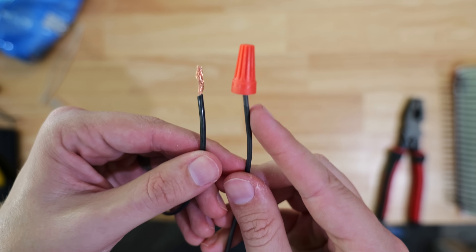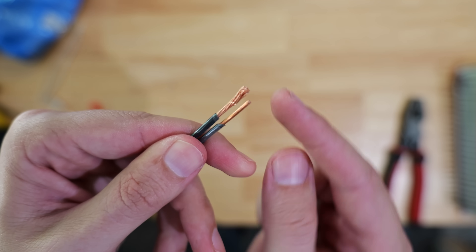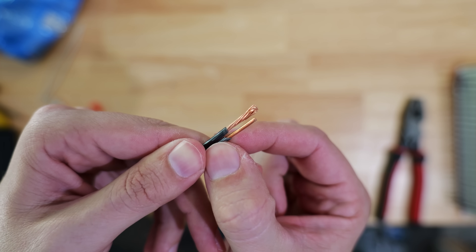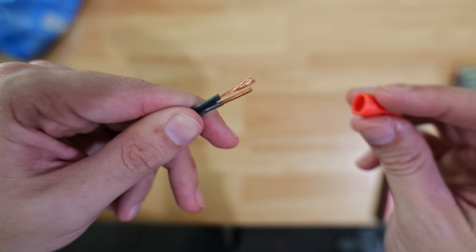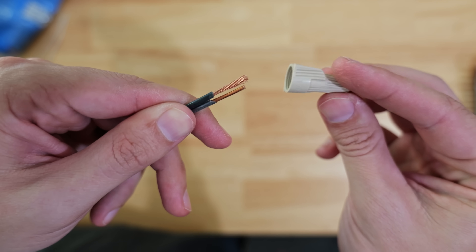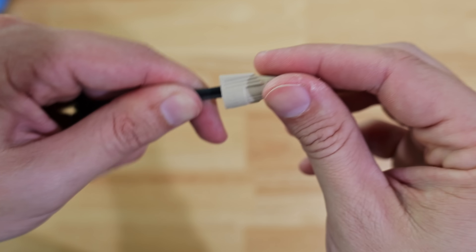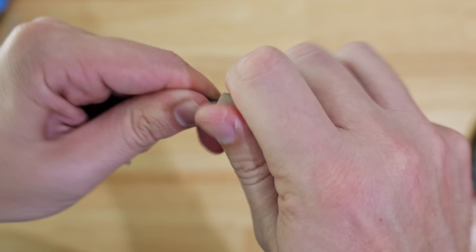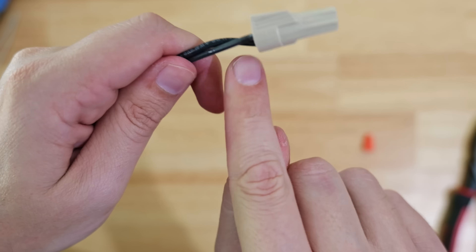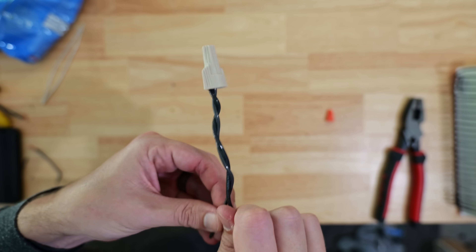The easiest way this should be done is to take your two conductors and make the stranded wire a little bit longer than the solid core wire at the starting point before putting the wire nut on. Instead of using a cheap wire nut, it's always better to use a name brand wire nut like the one made by Ideal, because they do a better job of wrapping the wires. Put those in and tighten it down, making sure to keep tightening to where you have some nice winding going on down below the wire nut.